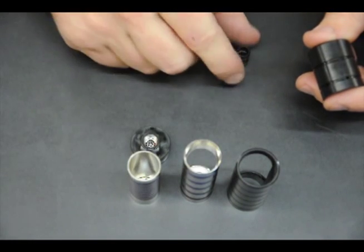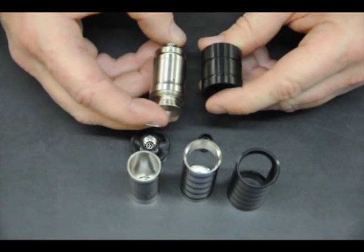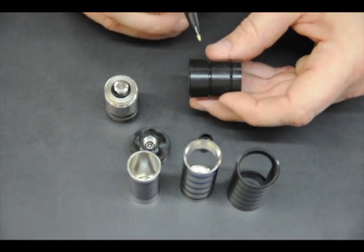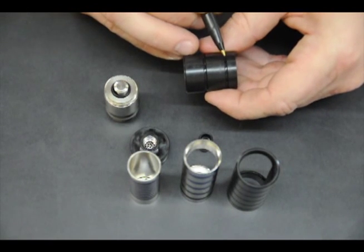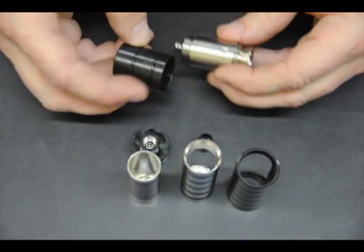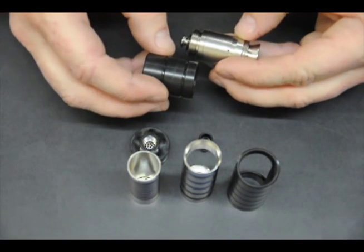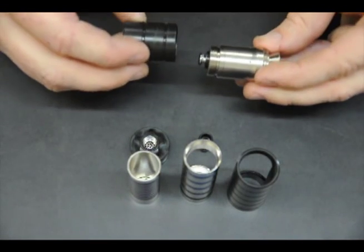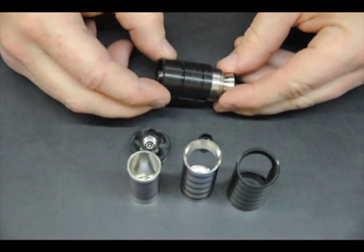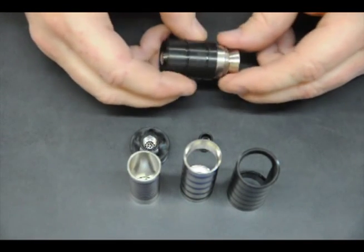From here we can put our middle Delrin sleeve onto our middle sub-assembly. One thing to note is that the middle Delrin sleeve is not symmetric. You'll notice the grooves are not symmetric — there are different counterbores on each end, and this groove has holes in the base of the groove, all the way around the device. When assembling this, the holed end faces the thermocore. Notice there are holes in the interface piece — these will be underneath the holes in the middle Delrin sleeve. Clocking is not important; just push the sleeve on about three-eighths of an inch until it gets to that shoulder. You'll know why later in the video.